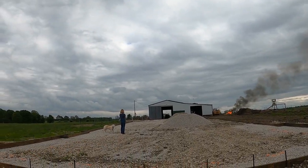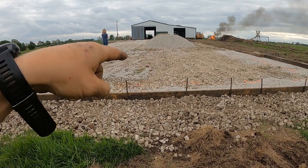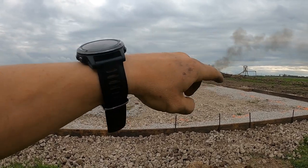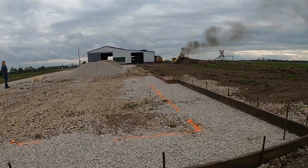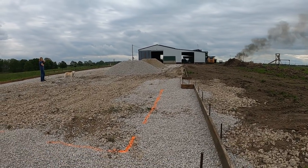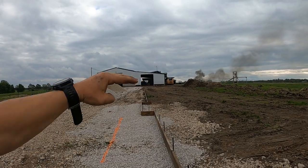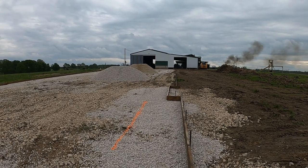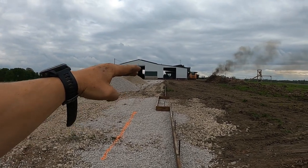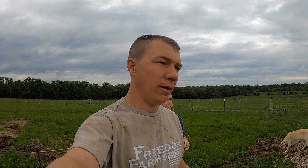We're doing clear span trusses — metal ones. We'll have a metal foot that goes down, and stem walls all the way around this. Back here they're going to be four foot tall for the manure storage reasons. We haven't decided yet whether we're going to step the stem wall or run it continuously. It's four foot tall here and just goes straight up to keep the platform that the trusses sit on level, because if it's not level it makes things more difficult. We'll either do it all the way down or go down so far, do a step and raise it up. Right now it looks like we'll step it because it's probably cheaper, but Eddie's doing the calculations.